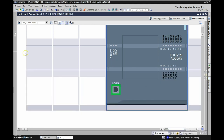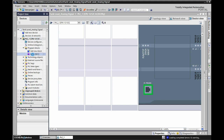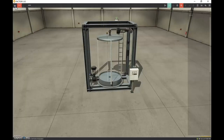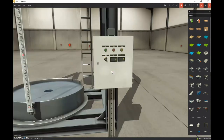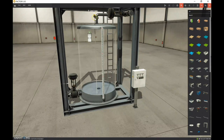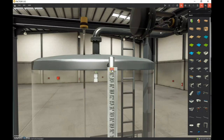Let's go to our main OB1 by left-clicking and going down to Program Blocks, then double-clicking to open it. All we want to do is have the level in the tank represented on the display in Factory IO showing the set point and process variable. The process variable is going to be the level from the tank, coming from the level meter sensor. Double-clicking shows the height of the tank is 300.